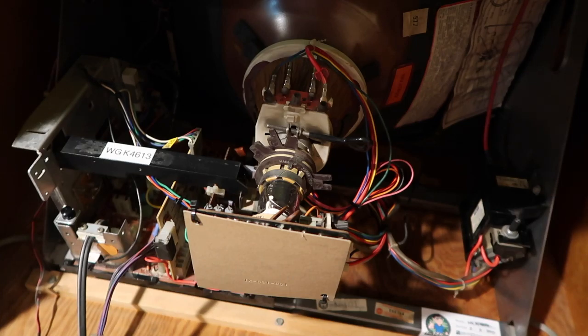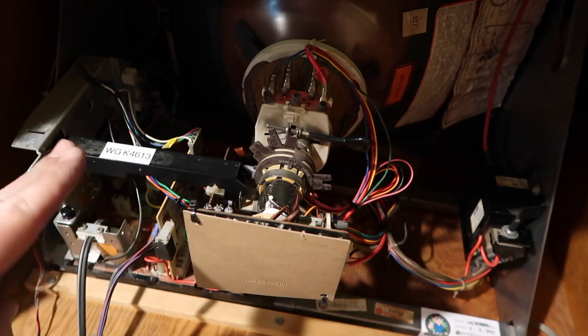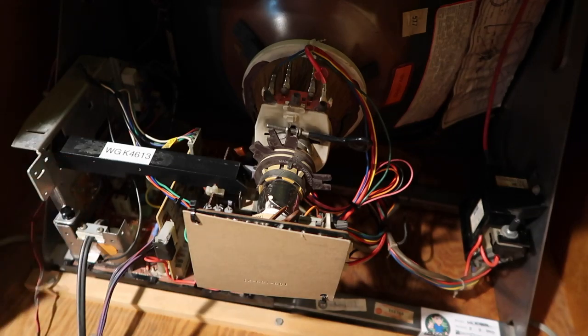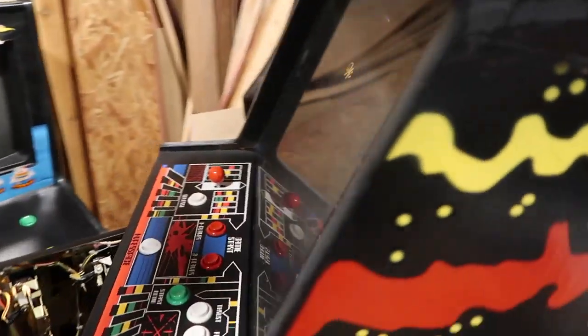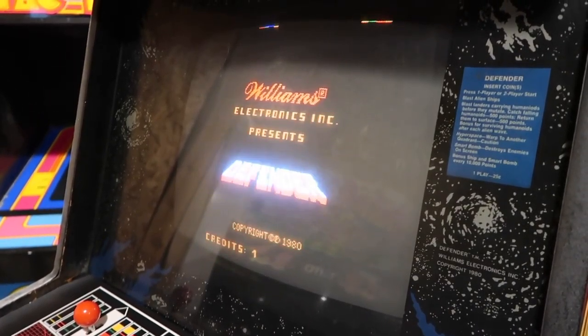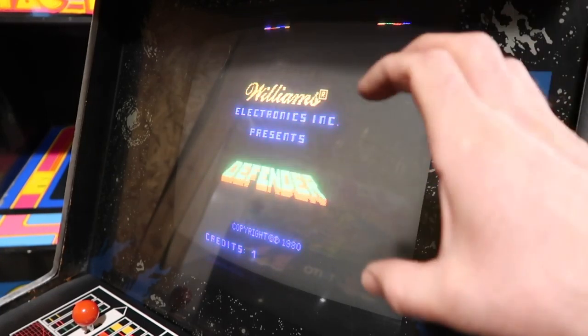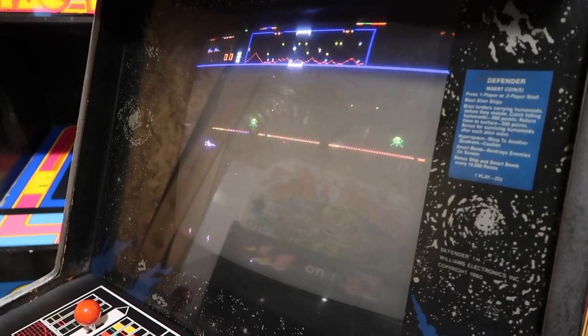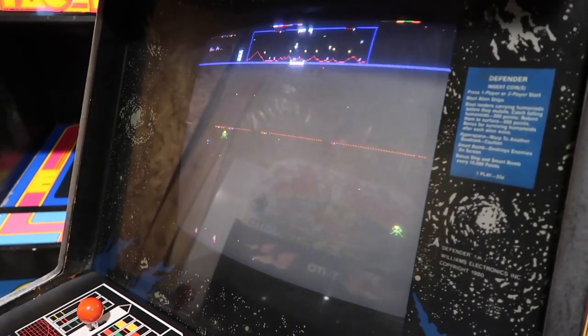Sounds okay... smoke, smoke, smoke — no smoke. Last time I did a cap kit on a 25-inch I did reverse a cap on the neck board, but I'm really just worried about that one that's not labeled. When I botched it on that bigger monitor you knew right away — you saw the smoke coming out immediately. I think we're good. Let's sneak around and see what the other side looks like. It's nice and clean. It still has the RAM issue but it's not jittery at all — success! It used to be shaking and flickering. I still have to fix the RAM but it's nice and clean now. Hope that's helped — I'll put links in the description. Good luck if you're doing this, take care.